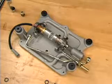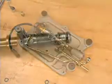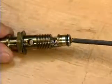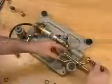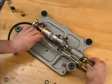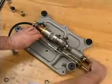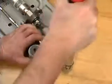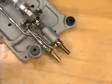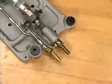Install the fuel lines, taking care of the following items. The ECM cooling plate check valve should be checked for cleanliness and freedom of movement. The check valve assembly is then installed in the lower outlet port. The fuel lift pump tubes are supported while tightening the cooling plate inlet and outlet fittings. Do not allow the tubes to bend.